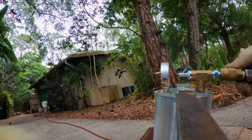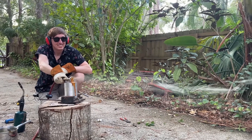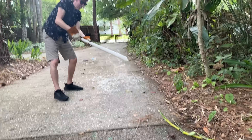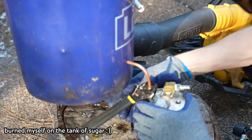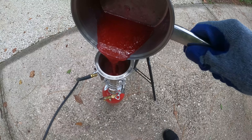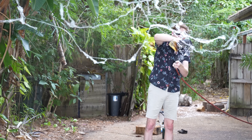It was kind of working. I spent a long time trying to improve this. I added a nozzle onto the end, which worked okay, but it sprayed molten sugar back at me. I tried a different nozzle design, but the sugar would just build up inside of the nozzle. I tried different temperatures, different pressures, different sugars, more nozzles — I am stickier than I've ever been in my entire life. I tried a nozzle that would squish the sugar between two streams of air. I tried pumping molten sugar into a cotton candy machine made out of an angle grinder. I even tried making a cotton candy air cannon out of a repurposed fire extinguisher and ball valve. But nothing worked as well as simply pouring the molten sugar into a stream of air. And you know what, that's probably for the best, because that means you can try it too. Just try not to burn yourself on any molten sugar. I'll see you next time. Bye.